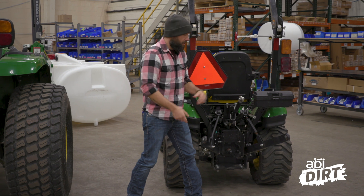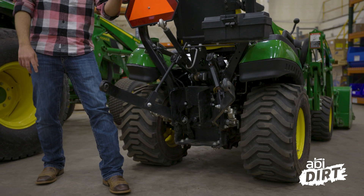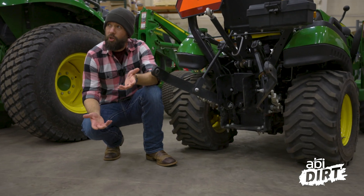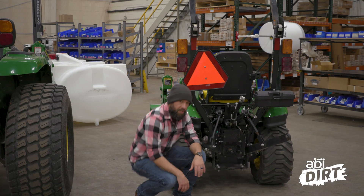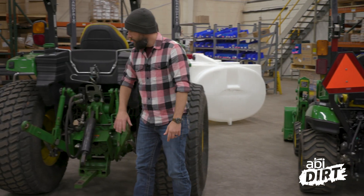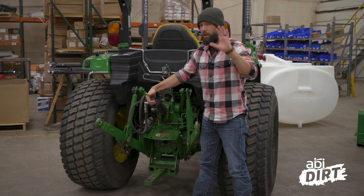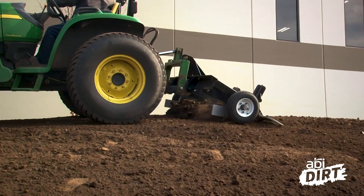The bare bones of it is that you've got three points of contact with the attachment, which allows the tractor to lift the attachment all the way off the ground. That little guy down there on the subcompact is your tow-behind hitch — you drop your hitch pin in there to maneuver pull-behind vehicles. Over on the 4 Series, you can still see this three-point hitch. On this bigger model we have a hydraulic top link — we've got a whole episode on that. We're big fans of the hydraulic top link; it gives you a lot of control of your three-point attachments.